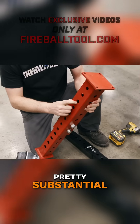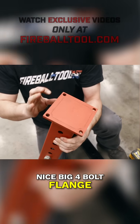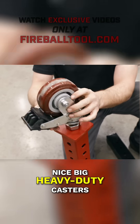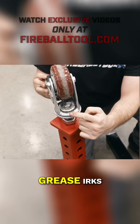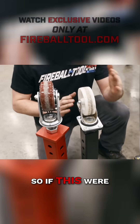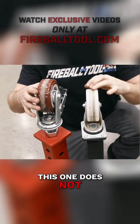Fireball leg — pretty substantial. We got 3/16ths tubing. Nice big four-bolt flange. Heavy-duty. Let's flip it over. Nice big heavy-duty casters. Brakes. Grease zerks. Much thicker caster design when you look at the sides here. So if this were to hit something, this could potentially fold over on the other one. This one has bearings in it; the other one does not.